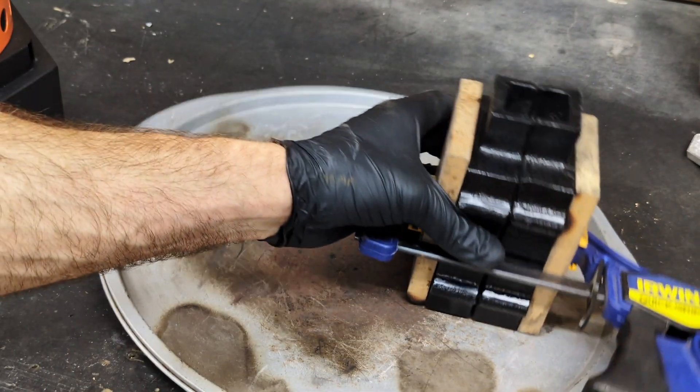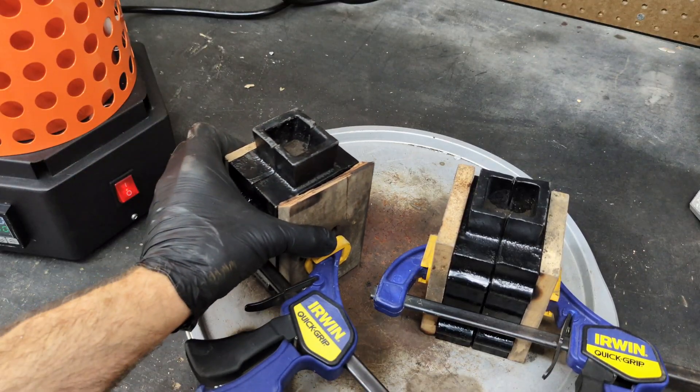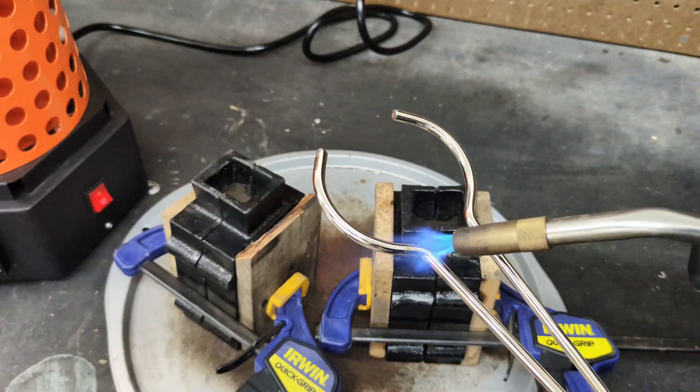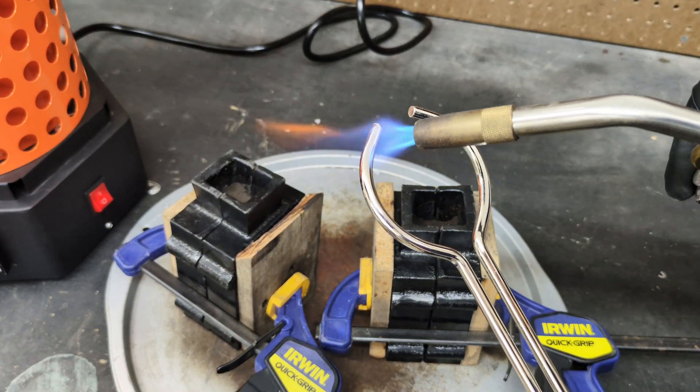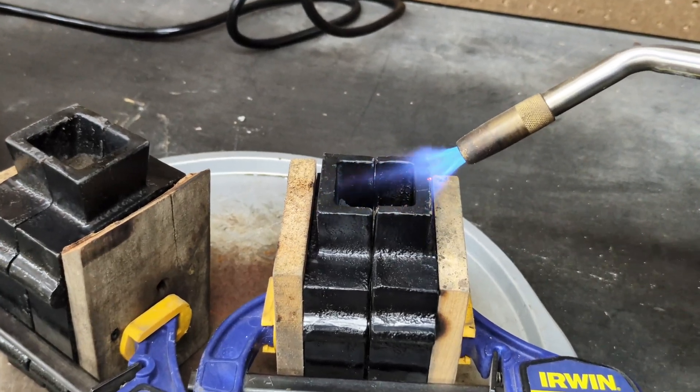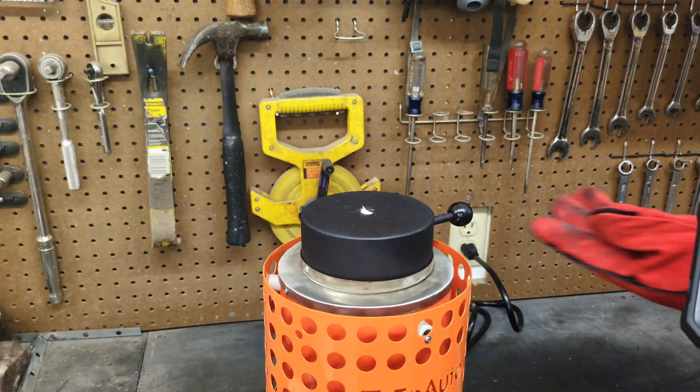Because I'm pouring on a wooden bench top, it's smart to add a splash pan underneath your flasks. Before pouring molten aluminum or grabbing the crucible, it's always best to warm your tongs and the flasks that you're pouring the molten metal into.